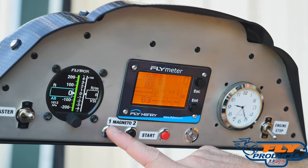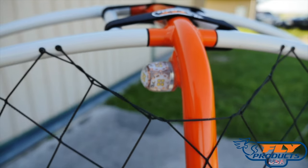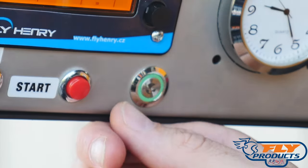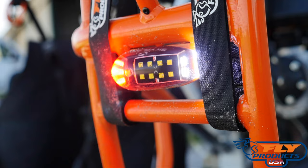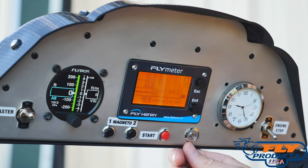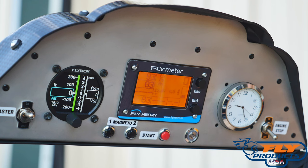You can see these buttons here: Magneto 1, Magneto 2, Start, and then there's a little silver button — this is for your SkyFlar strobe system. To turn this on, you simply push it down until it blinks and let it go — this is our strobe. You can see the green light blinking; that is how often our strobe is flashing. If I just tap the button once, the strobes change mode. One more time — now they have a much faster strobe. One more — now they're consistently on, steady on all the way around, including the white lights. If I tap it one more time, these are just our running lights on the left and right, just like an airplane. To turn this off, you simply hold it down and let it go, and the system is now off.